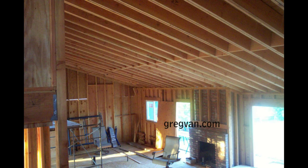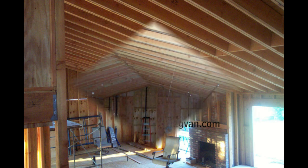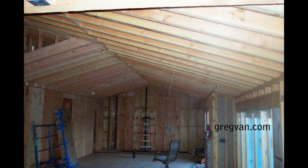The engineering components like the roof rafters might actually end up creating a problem instead of solving one. To make matters even worse, they went ahead and added another roof to the interior, putting additional stress onto the already under-engineered — and this is my personal opinion — under-engineered roof rafters that were already sagging. I went outside and looked, and it did appear that the weight of this thing actually caused it to sag a little more, though that could have been an optical illusion.